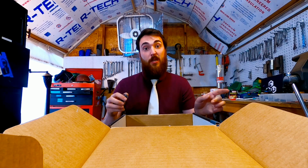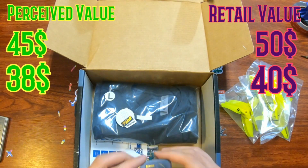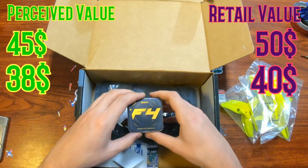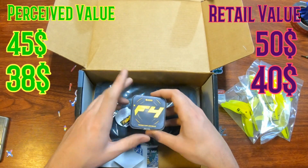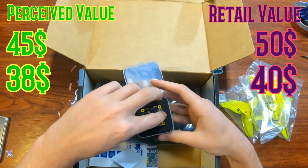There's a lot of places where the ground goes to the power and the power goes to the video, so make sure you double check on that board. Just real quick, wanted to make sure you knew that before you went ahead and fried your board you got from the FPV crate. But yeah, let's go ahead and look at this guy.